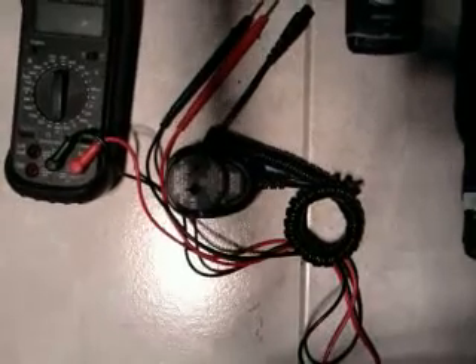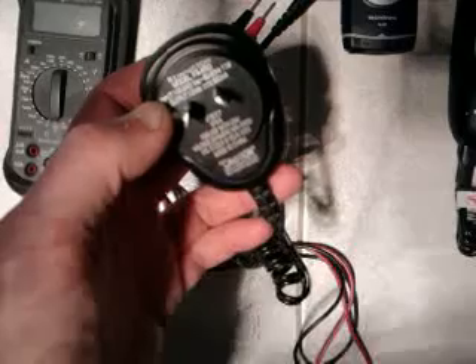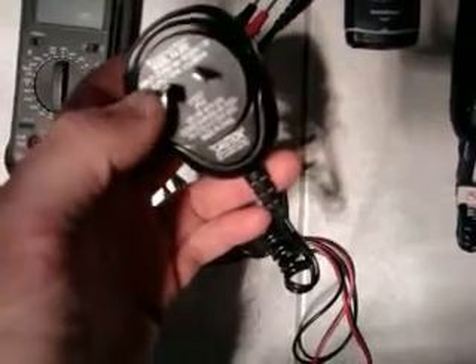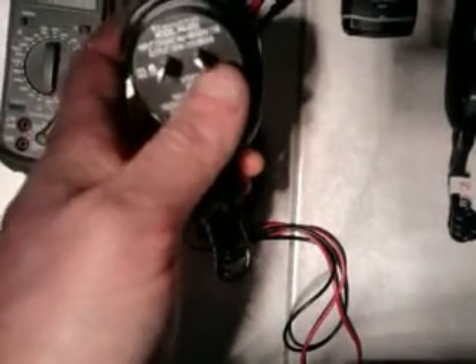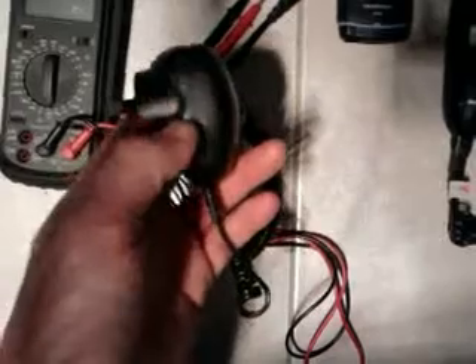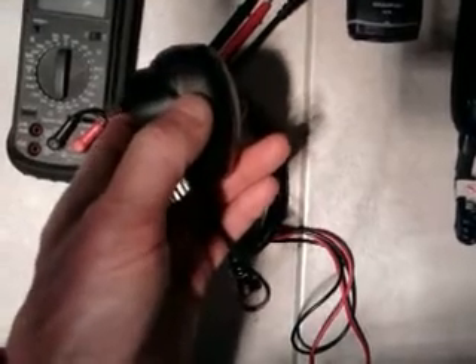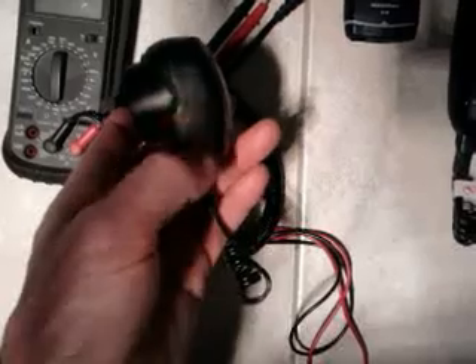And you may say, well what's the point of that? Well, first of all you don't lose the little bit of power — you know, the 7-8 percent or whatever you're going to lose out of your inverter. And also if you start doing the maths on the input and output ratings — this one says 11 watts — I guarantee if you measure the DC volts and amps it will be less than 11 watts, because in the conversion from 12 volts to mains and then back to 12 volts again, you lose power both ways. Stupid.